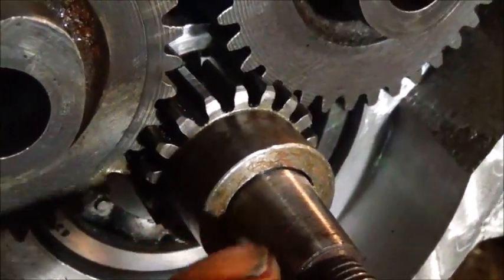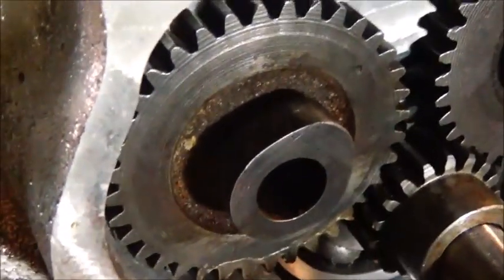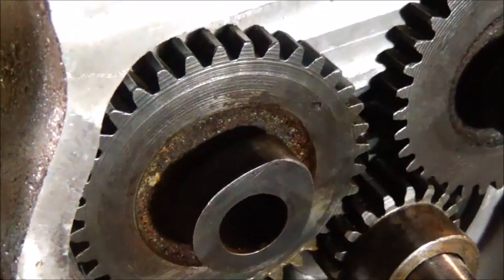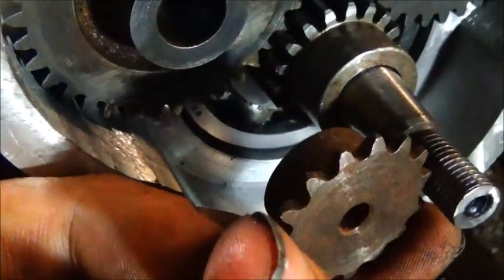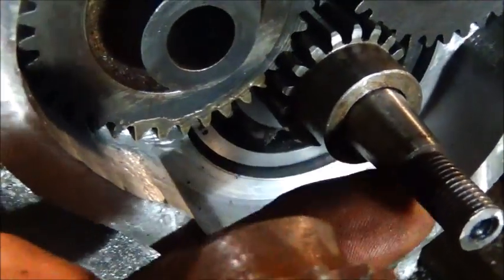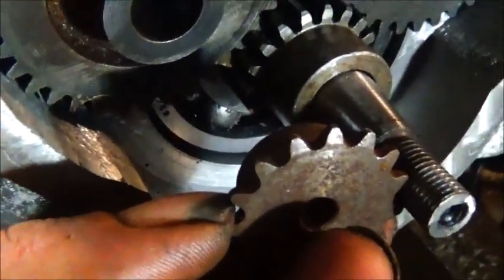I'm going to make a bushing here, but we don't want the bushing to turn. I can actually make it so when I put the sprocket on the outside, I can use these threads and put a nut on it, or I can drill it and put a bolt in it - it'll probably look better with a bolt. What we'll do is this will go on and actually push this bushing up on this taper, which should work out fine to hold it. This will have to be keyed - even if I key it into threads, that's not a big deal.